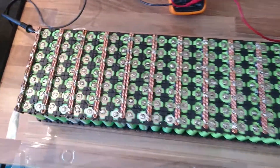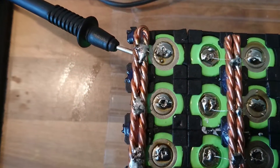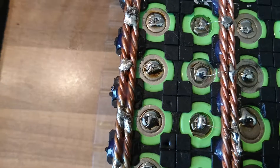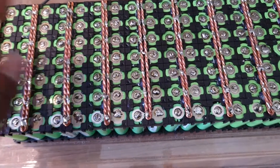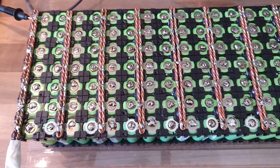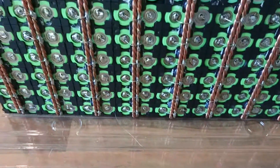This is working very well. Let me zoom in on the fuses — as you can see, I've put fuses here. These fuses are only 5 amps, so they will break at 5 amps if anything goes above that. I want to save the cells, so if anything goes above 5 amps the fuse will break.